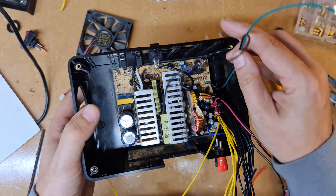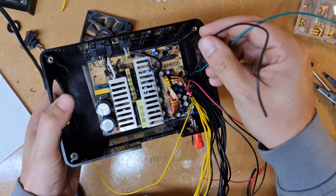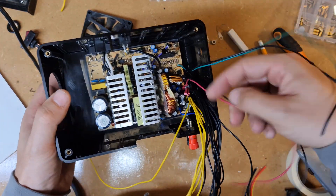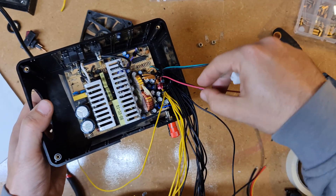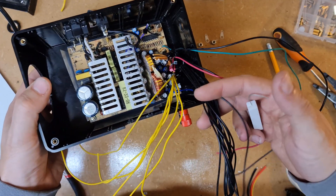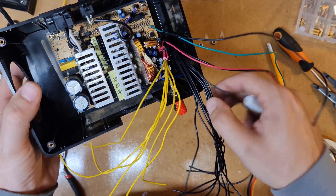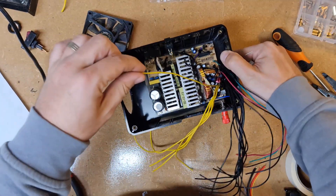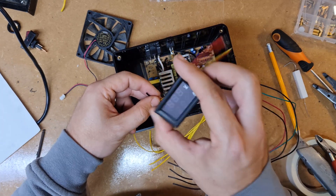The green and black need to be wired together - that's the power-on wire, which would normally go to the switch on the front of the PC, but if you wire them together it pulls to ground and makes it work. The large power resistor is going to go between 5 volts and ground, just to put some load through it. Then the 12 volt and ground leads - I may not use all of these, I might just take half - and put those onto the terminal post, with a spare ground and 12 volt to wire into the sensor.